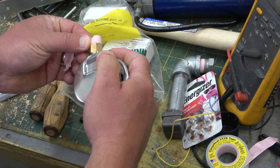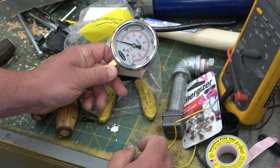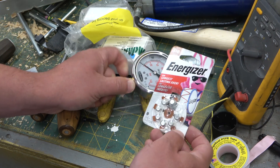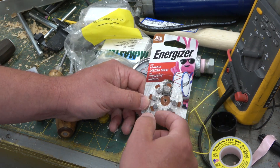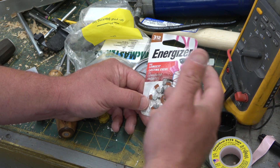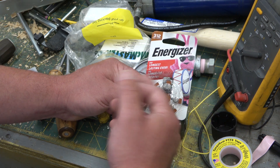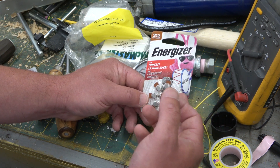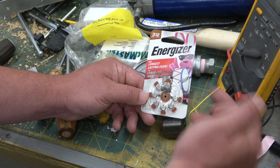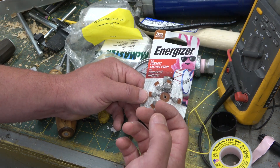I asked Big Clive if we could do some further testing, and it turns out I'm a little better outfitted for doing high-pressure testing of the hydrogen generated from the zinc cells. These zinc batteries from the previous video, they can go one of two ways. They can react at 0.4 volts and generate hydrogen, or if you connect them up in an electromechanical contrivance of some sort, you can get one and a half volts out of them. We don't want to do that reaction — we want to do the side reaction that generates hydrogen. The other reaction takes oxygen out of the air.